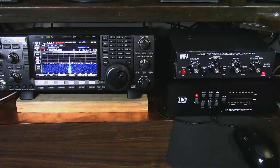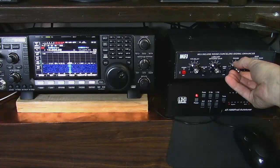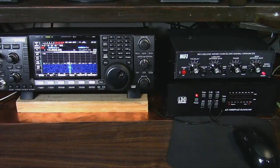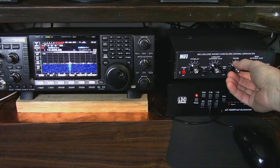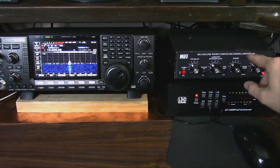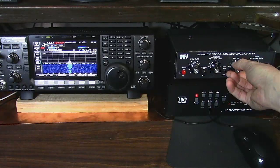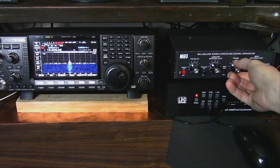We're still going to hear WWV in the background because this is coming from skywave. What's happening is, because of the ionosphere, the phase of the signal arrives at my noise antenna and my main station antenna — which is a full-size 40-meter loop at 35 feet — at different angles. So in order to fully reduce WWV to nothing, I have to keep adjusting the phase control and possibly the antenna gain. You can see the phase changed and WWV came back.